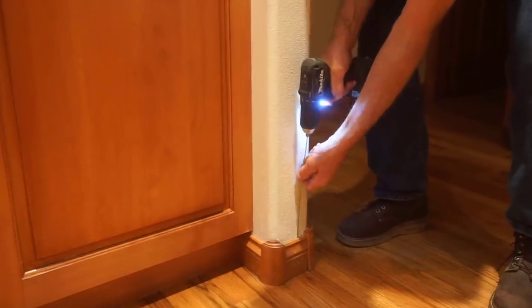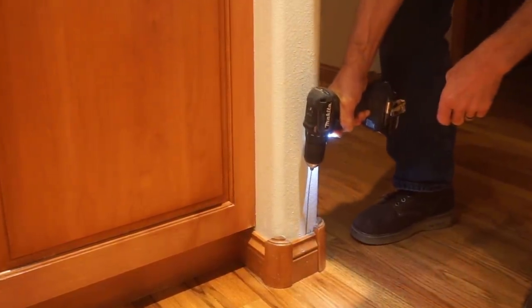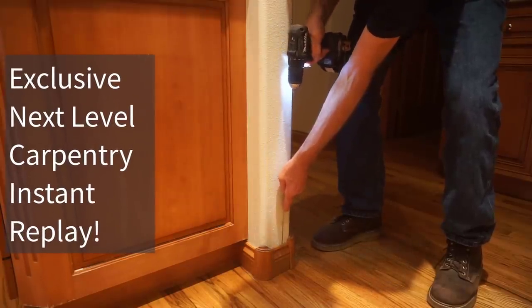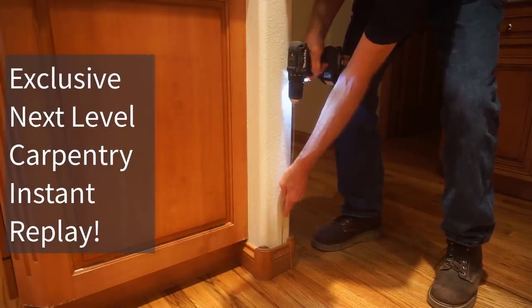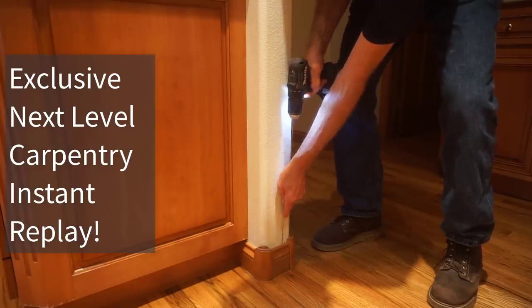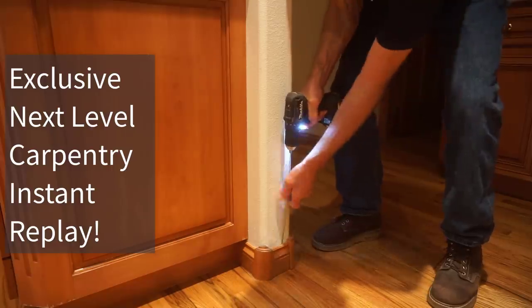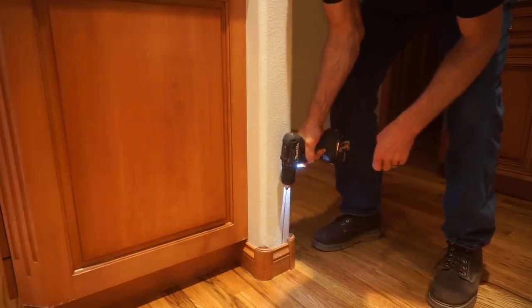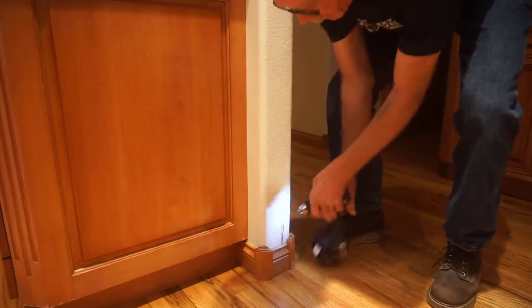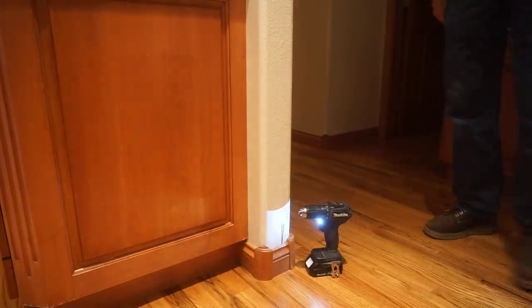I'm careful doing this to make sure I don't drill through any plumbing or electrical that might be hidden below — every superpower has its limitations. So I use extra caution if there's any unexpected resistance. Here I expect resistance behind the baseboard and then the three-quarter-inch plywood subfloor below. After that, I stop right away if I feel anything slowing down and investigate. In this case, the wire runs free once through the subfloor, and I can just un-chuck the wire from the drill.